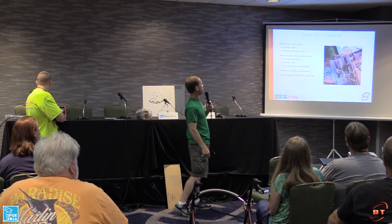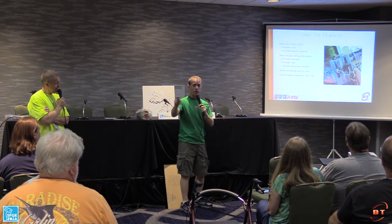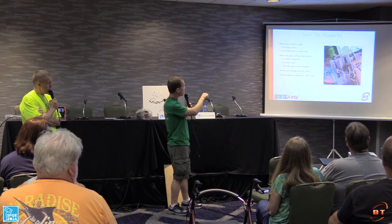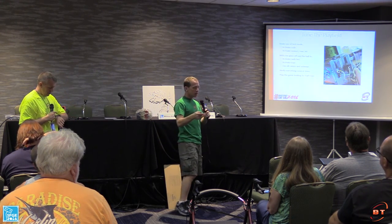And then tune the play field, all right? And this is a patience thing. Take the ball and exercise everything on the play field. You've got test mode, make use of that again. Activate all your coils and all your toys, make everything move, make sure nothing binds.